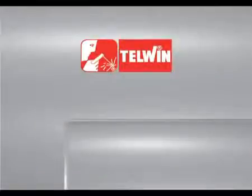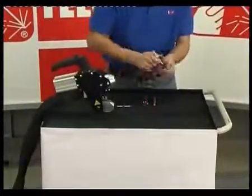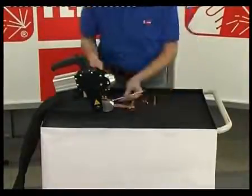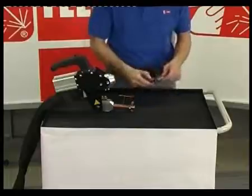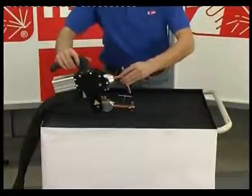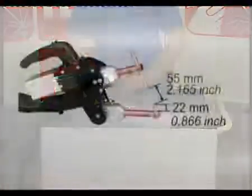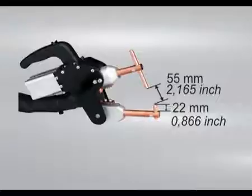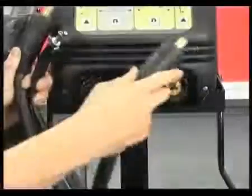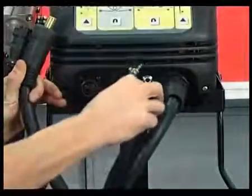Tooling the clamp. Follow the instructions in the handbook to fit the clamps with supplied arms and electrodes. Center the electrodes and respect the recommended distances. Connect the various clamp cables to the machine. Connect the compressor air supply at 6 bar and switch on the machine.